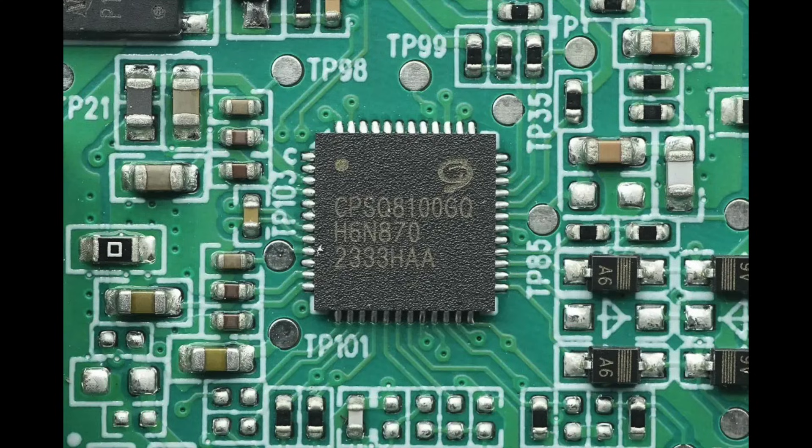The wireless charging master control chip is from CPS, model CPS-Q8100. It is a highly efficient and highly integrated wireless charging transmitter chip that supports 50 watts proprietary protocol wireless charging. The chip integrates a 32-bit MCU core, full-bridge driver circuits, Q-factor detection circuitry, and modulation-demodulation circuitry, minimizing the need for external components. The internal memory supports read/write protection and features I2C and UART communication interfaces. It includes three half-bridge drivers, which can be configured for synchronous buck or synchronous boost operation. The chip provides hardware over-voltage/under-voltage protection, over-current protection, and over-temperature protection. It meets AEC-Q100 grade 2 certification and comes in a QFN48 package.